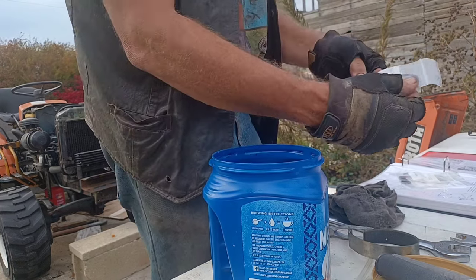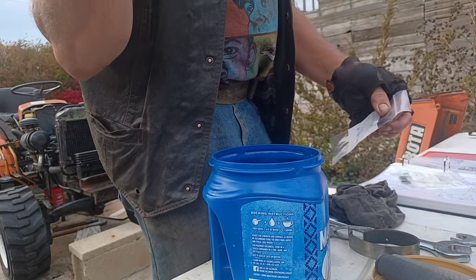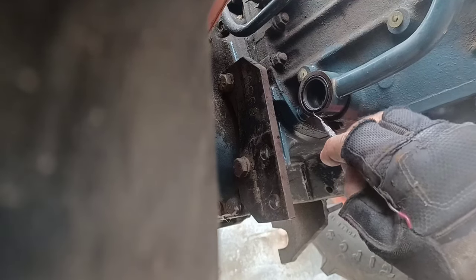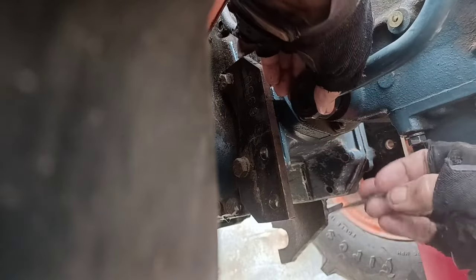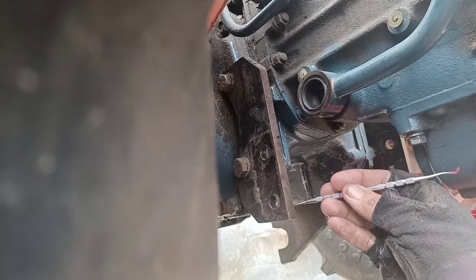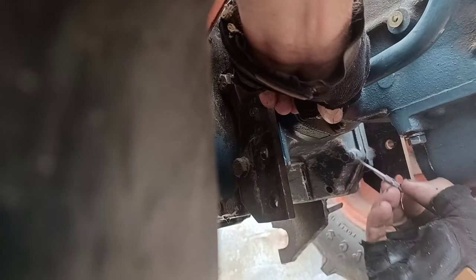We need the two O-rings for it. Those are 04811-10300. Takes two of them, and they both go on the piece that's still at the tractor. We'll go over there and show you that. Okay, there's an O-ring in each side of this pickup. That one's pretty easy to pull out. Got one that's going to be kind of blind to get into. Oh, dropped it. That's fine.